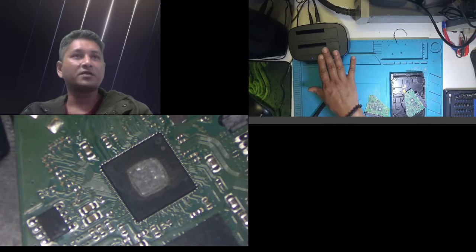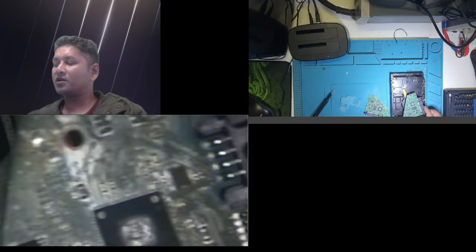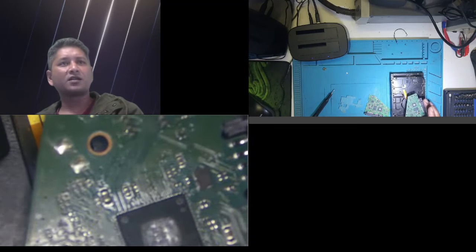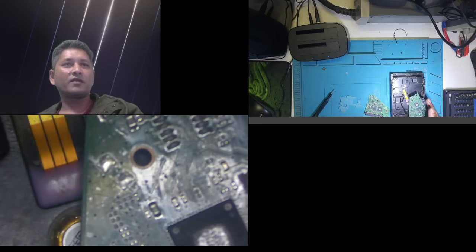With the old board, the hard drive was not spinning. But the new board, with this device, an external hard drive enclosure or reader, when I plug it in with the new board on the hard drive, the hard drive spins like crazy. It's like it's confused, it can't decide what to do. It spins for 2-3 seconds the first time, and after that it goes silent. There is no movement on the hard drive, and the computer cannot detect it. So a simple board swap didn't help me recover this hard drive.